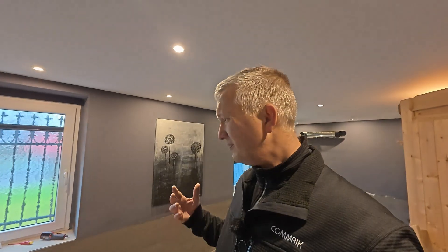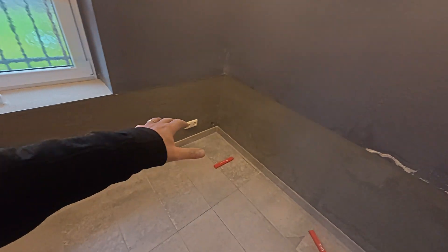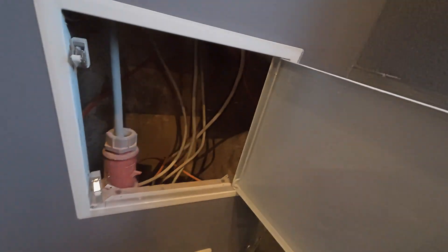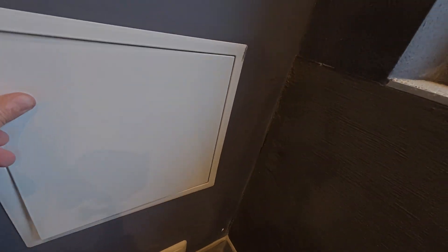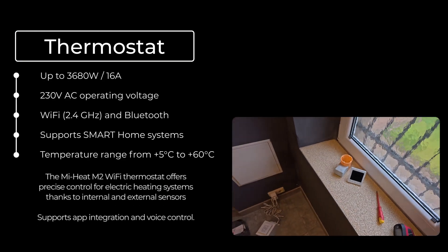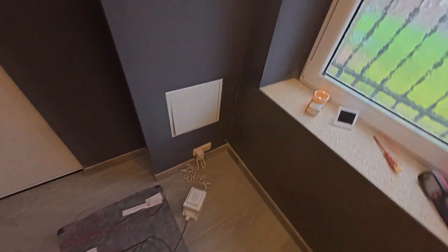Cement doesn't react as strongly to the moisture in this room caused by the sauna or shower, and there's also significantly less mold risk. I'm going to carefully skim the entire surface with the filler, applying it very thinly and evenly with a notched trowel, and I'll remove the electrical socket beforehand. I'm making holes through the wall for the two cable connections, and down below I'll install the transformer on the wall. I'll install a hollow wall box on the side for the remote control — this model comes with Wi-Fi control, meaning I can control everything remotely and monitor power consumption with the Shelly installed in there.